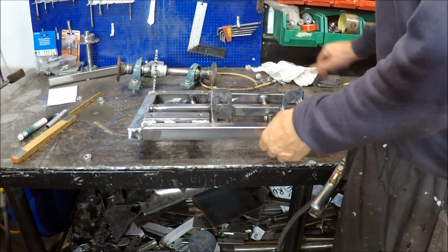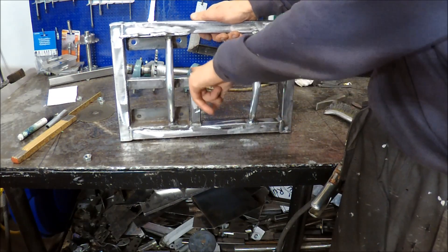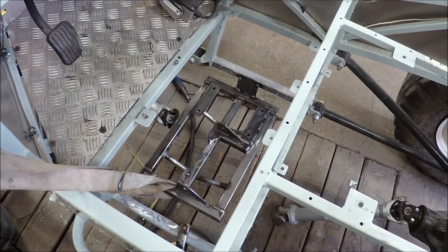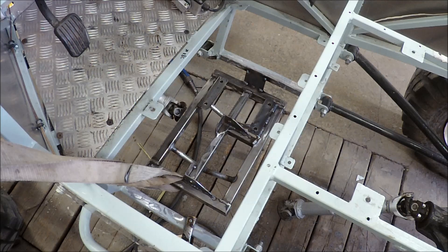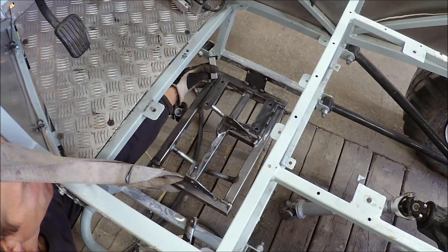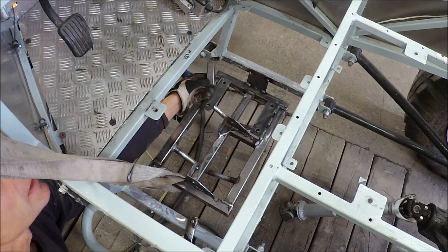The subframe is completed. I have done some flanges to make it stronger at the motor mount, and I also added some tubes underneath for protection for the lower fixing point for the motor and also the sprocket — so if I hit a rock it wouldn't be damaged. Now I have the subframe for the transmission in place. I used a steel plate and also my telfer to get it in position, and now I will figure out how to make these small fixing points and get good strength for the trailing arms.